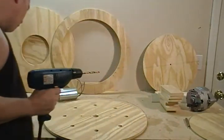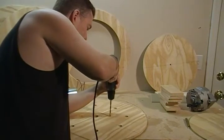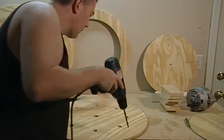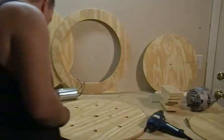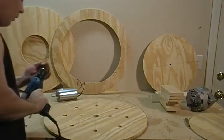The smaller hole we're going to open up to a 5/16ths, which is a nice slip fit for our bolt. And we're going to stick with the 25/64ths drill on the larger hole.